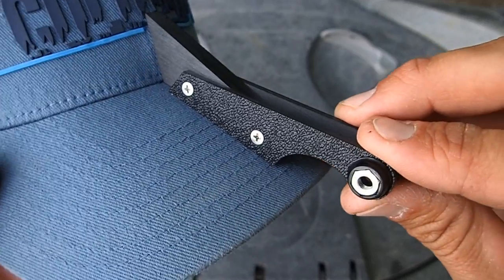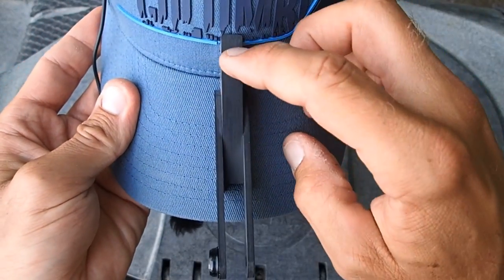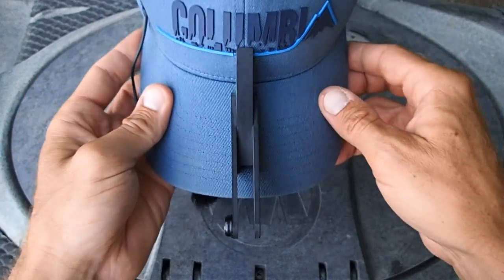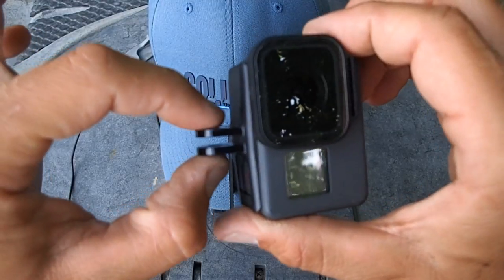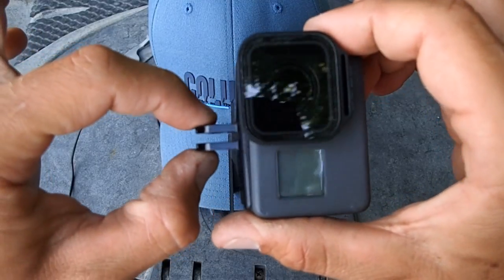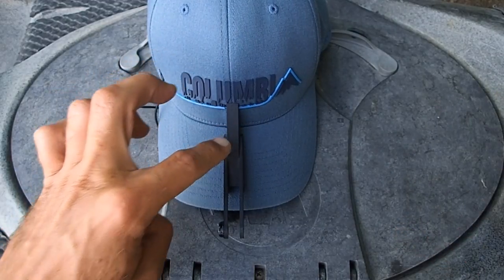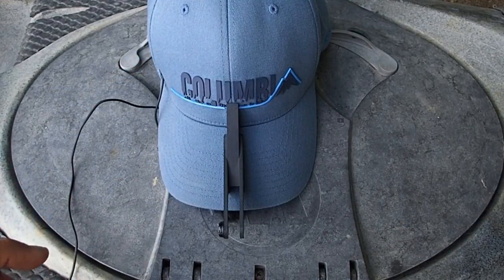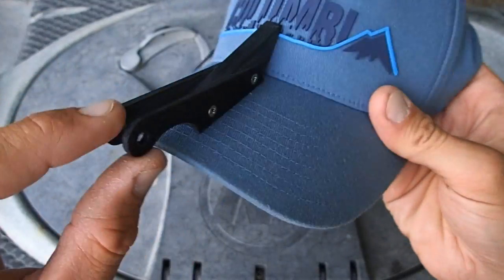The part that actually holds onto the GoPro I made myself out of ABS plastic. I used 3/8 inch thickness for the middle piece — if you measure the distance between the outside of the two mounting tabs on a GoPro, that's about 3/8 of an inch, so this plastic worked perfectly. Then I used 1/8 inch ABS for the two arms that hold onto the GoPro.